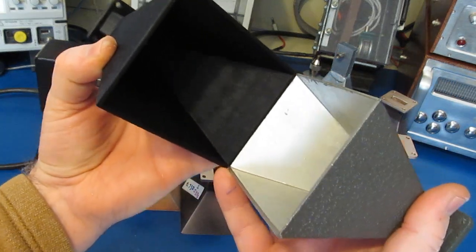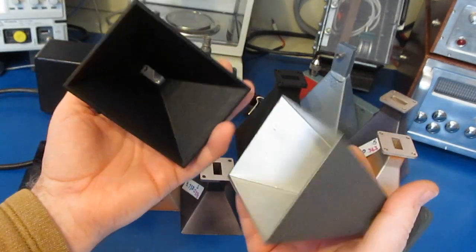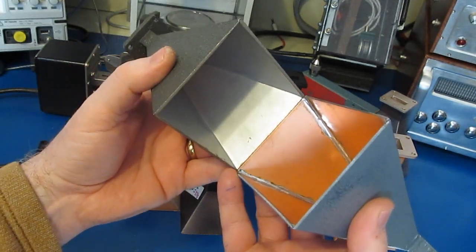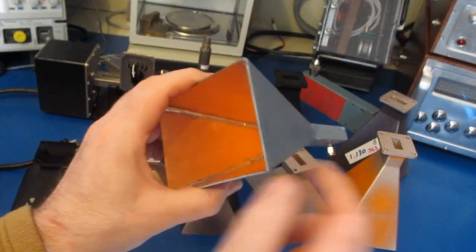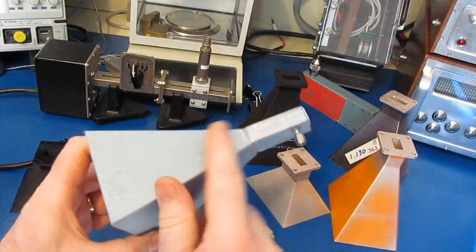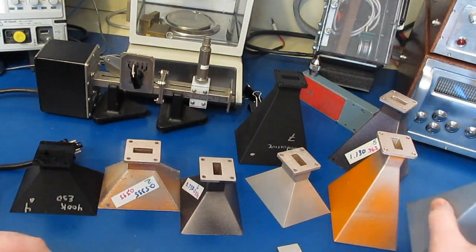As a matter of fact, if you look at the inside dimension, you can see that this horn is actually modeled after this horn. Now our circuit board horn that I've cobbled together is a little off, fairly close, but the big problem with using this as a baseline isn't so much the dimensions of the horn, it's this transition. We can go ahead and measure this, but I would expect, just because of the transition, the results for this is going to vary quite a bit.